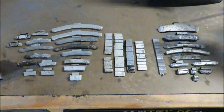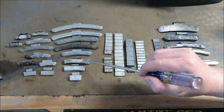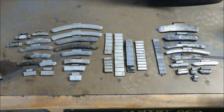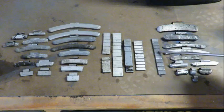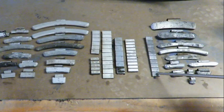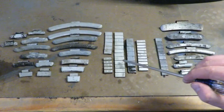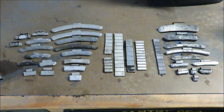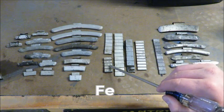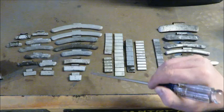These guys look a lot like these guys, and it can be hard to tell the difference right off the bat. These are tricky as well because they have a coating on them that makes them look similar. This lead wheel weight is going to be almost pure lead — I'll usually filter that out and save it for other types of ingots. Some common markings you want to filter out are FE and ZN. If you ever see FE or ZN, just toss it.